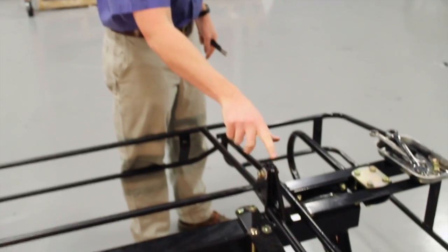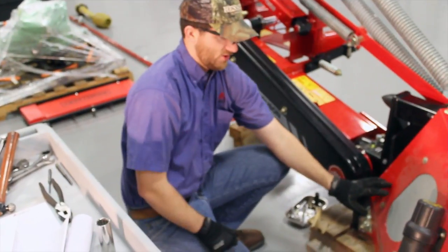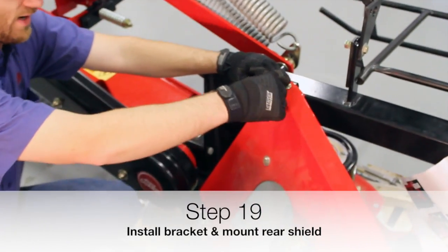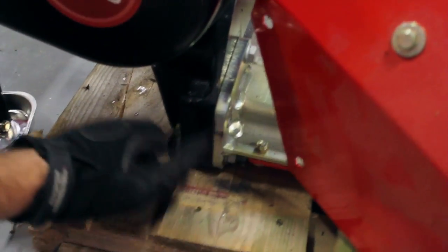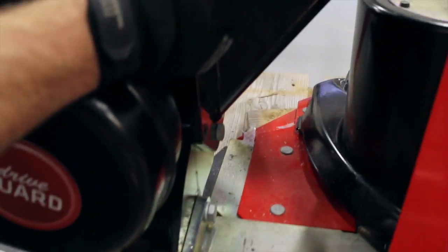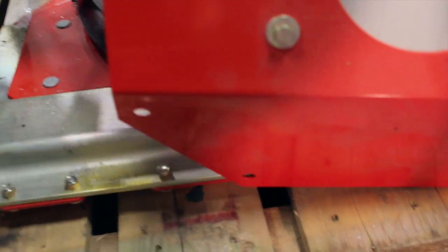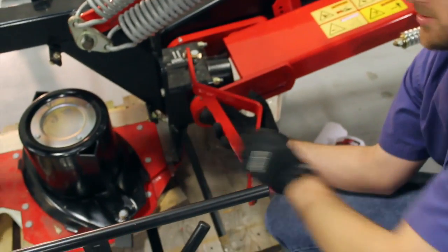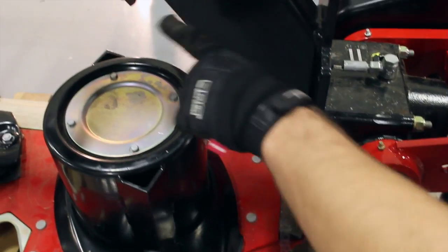Make sure that your nuts and bolts are on the top hole, otherwise your curtain will never pivot. The shield provided with the kit installs on the back side of the mower — up here you have a bracket that a carriage bolt pokes down through the top side, and down here we'll have to remove one bolt that bolts the cutter bar to the back frame and one bolt that bolts the backbone to the gearbox. They'll have to be removed so the shield will bolt up to these two holes. It's probably a better idea to install this shield at the same time you're installing the backbone to the gearbox. In the next step we will mount the front shield, which has a bracket that bolts up here and provides support for the front shield that then bolts to these two holes on these welded brackets.